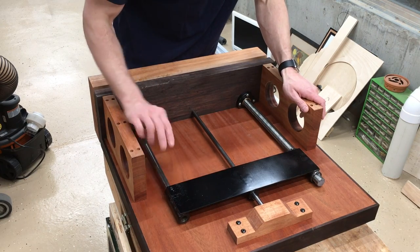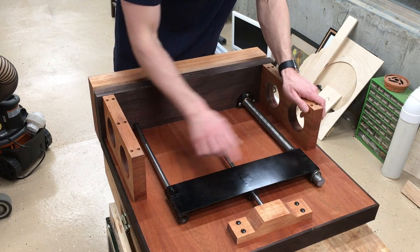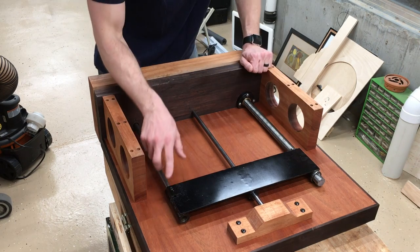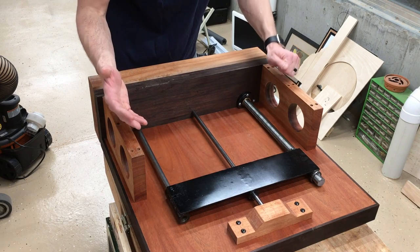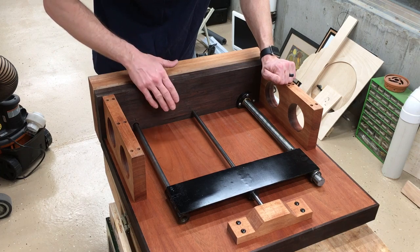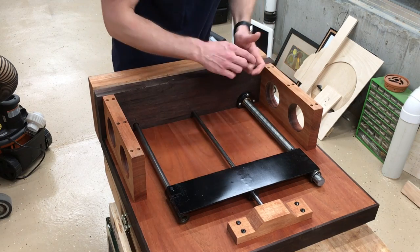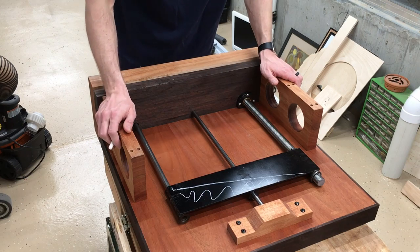And the other thing, we have a lot of wasted material here. This is the point where all the torque is happening. This is just a single point of attachment, and in fact, I only have this rod about 3/4 of an inch in right here, because actually having this rod able to pivot around this point, it doesn't hurt anything and actually helps with alignment. This is gonna be something that a woodworker puts together. It's not gonna have machine shop precision. So a little bit of play in here actually helps. So everything above this line is really wasted material.